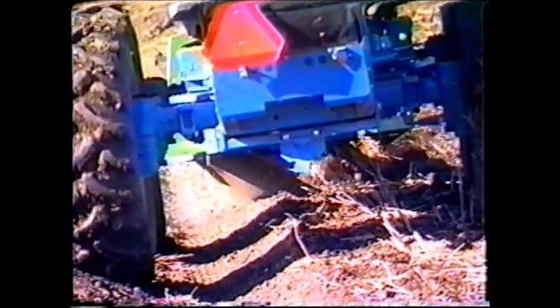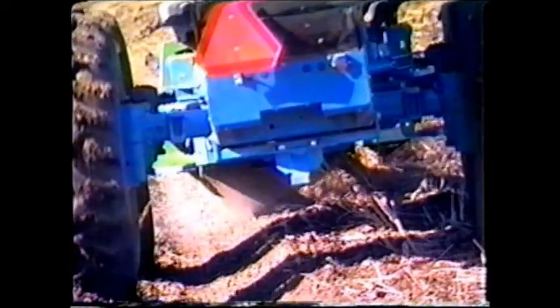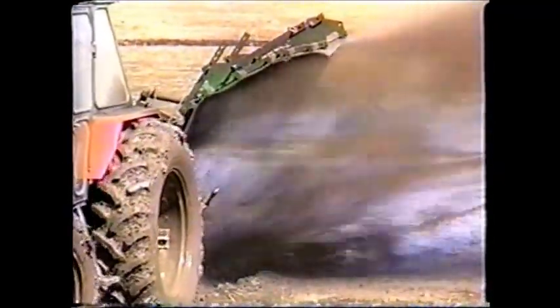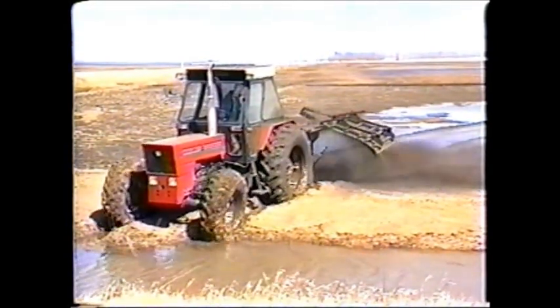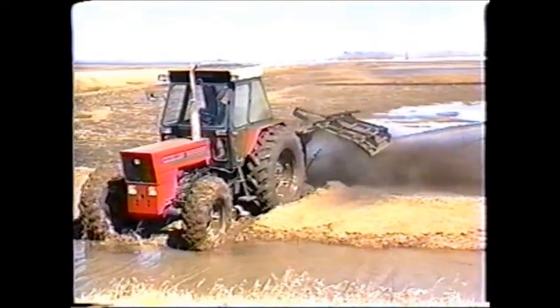The rotary ditcher is more than an alternative to other ditching equipment. It's simple to operate and has proven to be very reliable. In the spring of the year, it offers the flexibility of working in flooded areas with very worthwhile results. In comparison with a scraper, the dirt is spread evenly instead of in lumps that have to be reworked. Smaller horsepower tractors operate the ditcher, both 2- and 4-wheel drives, although 4-wheel drive tractors are preferable in flooded areas.